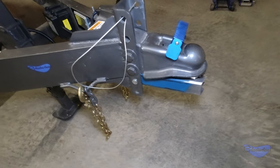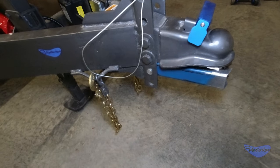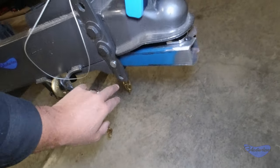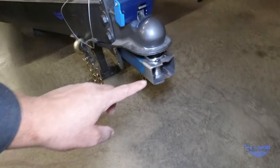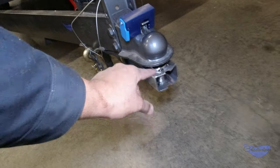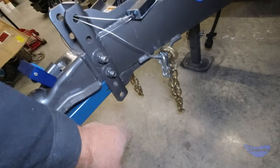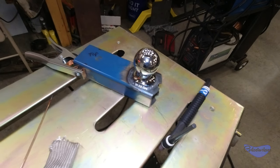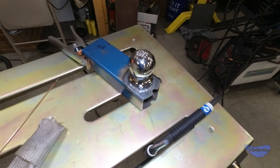This gets you a better idea of what's going on. This pin is actually going to be a hitch pin that will lock in place. This lock will still be here, and then there's going to be a piece that comes down and it will block this hole right here — or this pair of holes. So this guy is going to be welded in solid. I'll weld it inside, on the bottom, and all the way around. You'll have this lock and the lock that will be on the bottom. Not my best welding but not my worst, so it's not going to fall off. Now I'll make that leg and this will be pretty much done except for some paint.